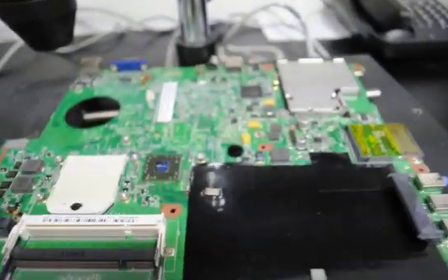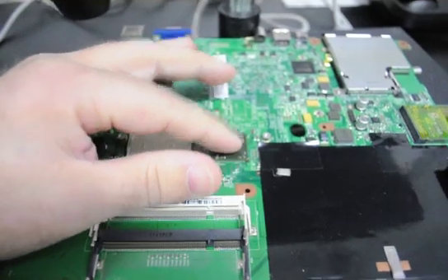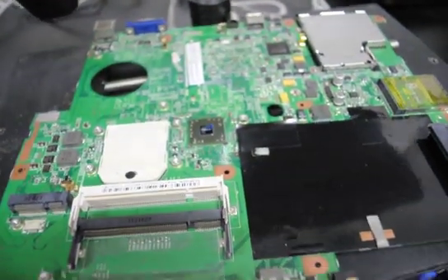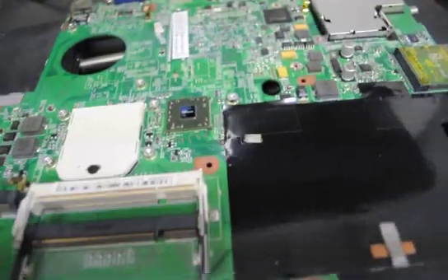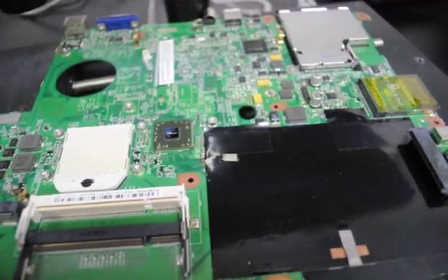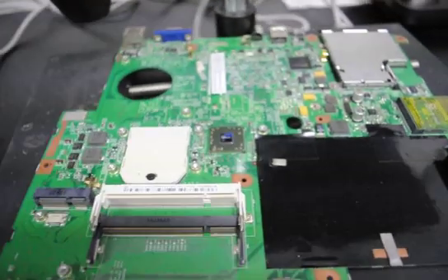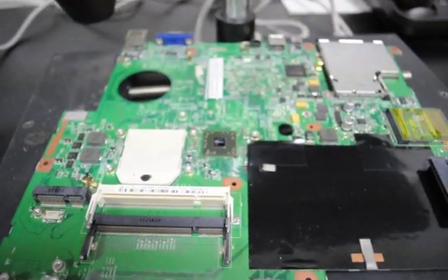The distance and exposure time is the same as the DV9000 and the later DV7, DV4 series reflow for an ATI, as it is with an NVIDIA. We'll go from there and do that and see what we can do to fix it.